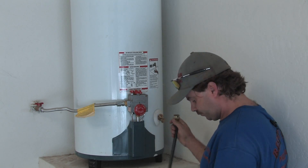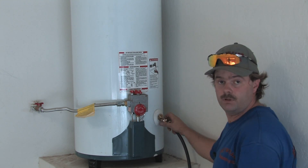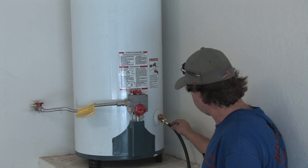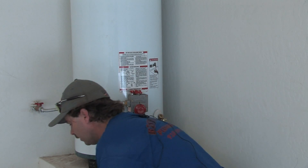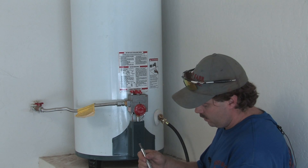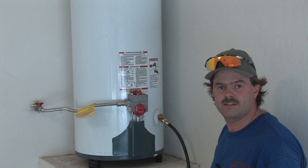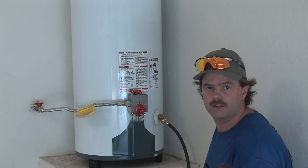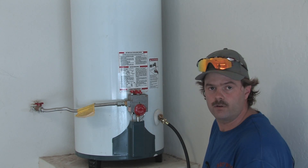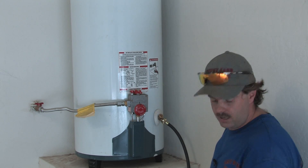So the first thing you want to do after you shut your gas off is go ahead and hook your hose up to the drain valve. Now before you shut any valves off anywhere else, go ahead and get your screwdriver. This one has a screwdriver-type valve. You get in there and commence to twisting, letting some of the sediment out of the water heater, creating kind of a double process. It also blows the valve out so it won't plug up with garbage from the bottom of your water heater.